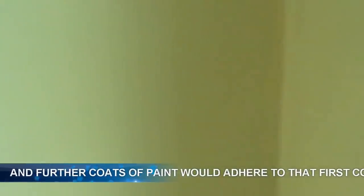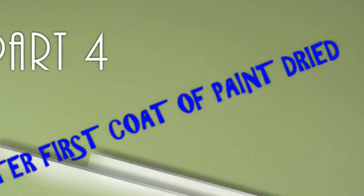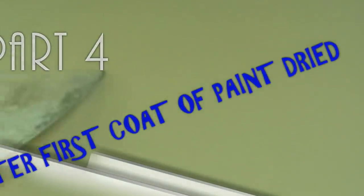The normal step now is to leave this fully dry. Yeah, I've only done this 5 minutes ago, you can see it's on its way. Once it's fully dry, you check over the surface, and sometimes you might find little lumps. Yeah, and you just get your scraper, take off the little lumps. Let this fully dry first, a couple of hours I would say, before you start scraping any little lumps off.